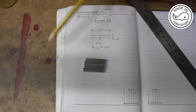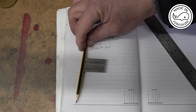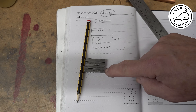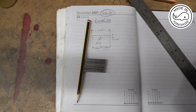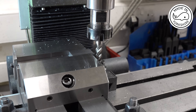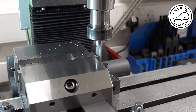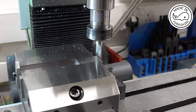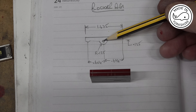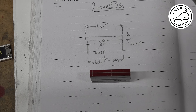I think what I'm going to do first of all is super glue them together like that, then put them on the mill and in one process mill these down to size — 1.475 of an inch. Then I'll drill and ream this hole an eighth of an inch. I'm going to try and do all four in one go; fingers crossed I won't get any run out.